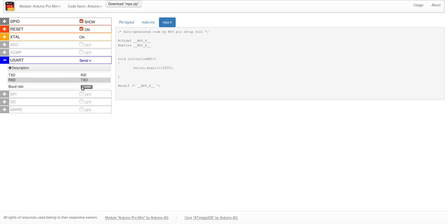Also, if we use the serial, we can have some other things to set. And if we set the SPI, then it disappears, and this is the part which is not written yet. Many parts are not written yet, but in this case there should be some code here which initializes this SPI, and you could use it in your project. So just by clicking here could provide you the interface, and you don't need to write a single line of code, just use it like the serial.